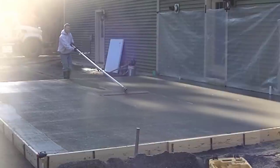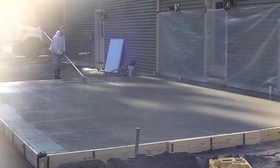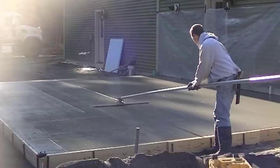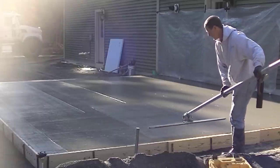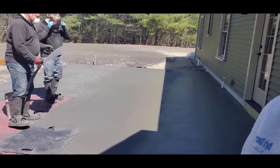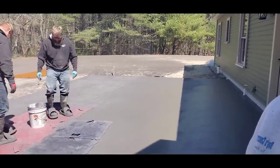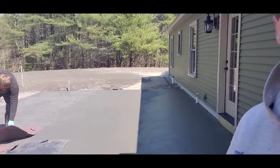That's a really nice 4,000 PSI mix with 3/8 aggregate — a little smaller stone than the 3/4 inch we'd use for a garage slab, but we like the smaller aggregate for stamping, it's a little easier. Now I'm finishing up bull floating and Darren's going around taking out my marks from the edges. Getting the slab bull floated really, really nice is one of the most important parts — it makes the difference between a good-looking and unprofessional-looking stamp. Here's a little preview of Luke and Darren getting on with the stamps, but that's what's in the next video. Make sure you subscribe, hit the like button, and stay tuned for part two.